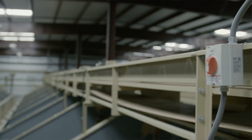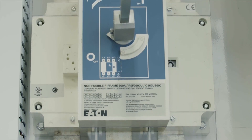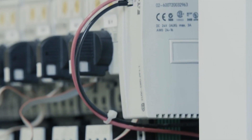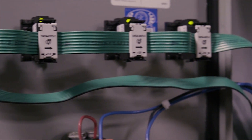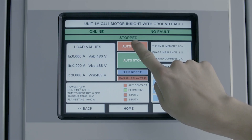It also provides diagnostic information over the network. For example, with electronic manual motor protectors with an interchangeable trip unit, you can monitor motor current, status, and trip conditions. This saves time and expense in adding and wiring a current sensor back to the PLC. Smart Wire also diagnoses status, so alarm fault connections and devices turned off can be monitored over the network and indicated over the HMI.